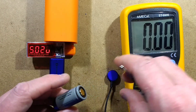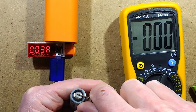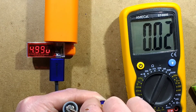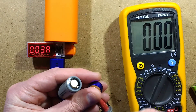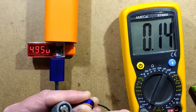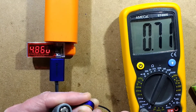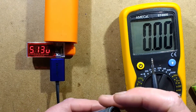What happens if I stick in a lithium cell now? It's not doing anything at first - I may have a bad connection. Or is this cell fully charged? The current is now ramping up - I think it was just monitoring and testing the cell. Now it's ramped up to about 700 milliamps, which is what it's rated at. It's showing about 700 milliamps in the USB power supply because the difference between the 5 volts and the roughly 4 volts going out is so close that the current will be similar.